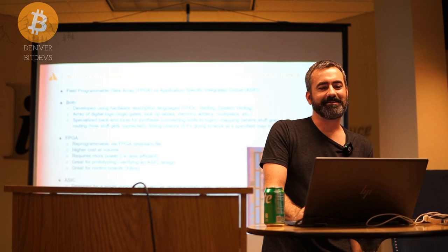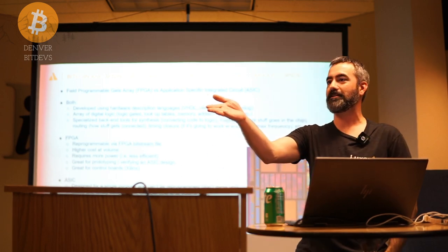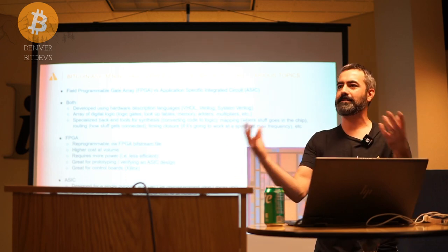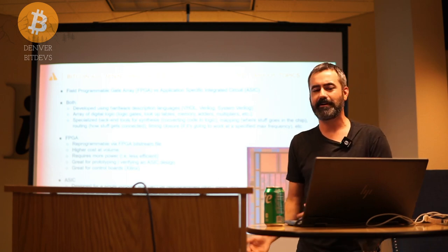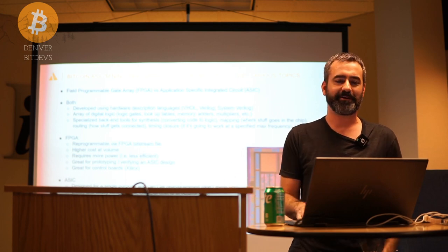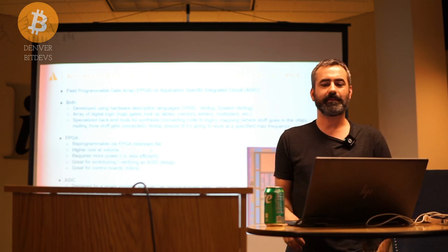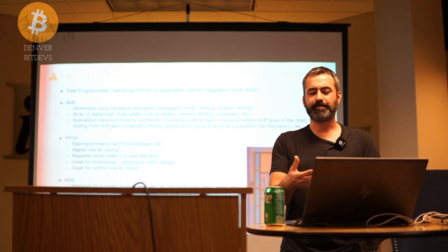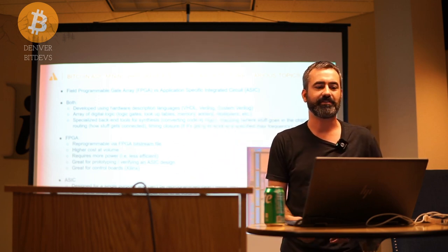Yeah. Let's do that. So FPGAs versus ASICs. This answers your question. They're developed kind of the same way at a design level. You use a hardware description language, VHDL, Verilog, or SystemVerilog. LuxOS's Bitstream is mostly Verilog, but we have a little bit of VHDL in there too. They're both an array of digital logic. They require specialized tools to turn that design into the physical implementation.